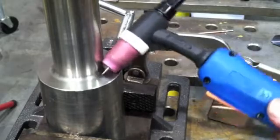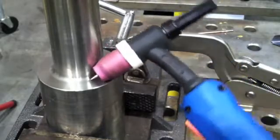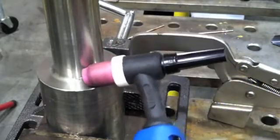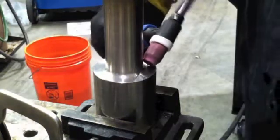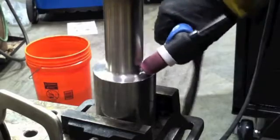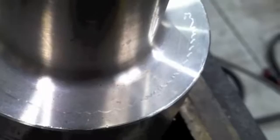So I'm going to show a little walk in the cup technique today on this thing first, and then we'll do some freehanding as well later on in the final pass. The walk in the cup, the first pass is actually more like wiggling the cup like this, just wiggling it. And it leaves scratch marks like this, so it's not actually tolerated in every industry.